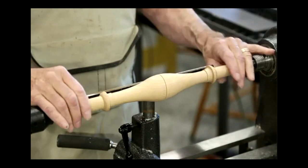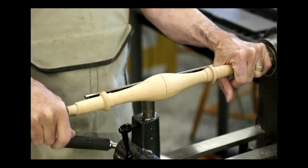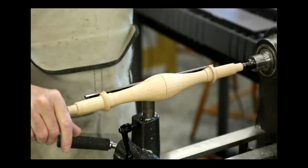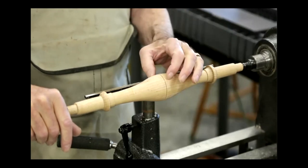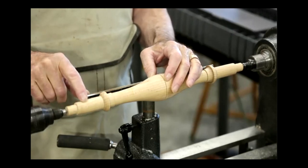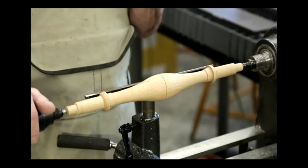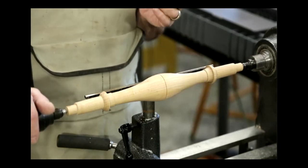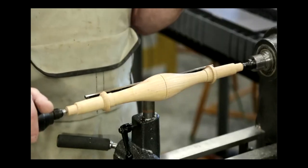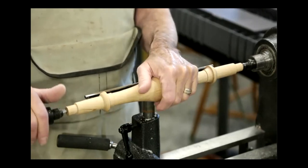You could be on a bobbin turning like this, and this goes in the bottom of a Windsor chair. The two chairs are going to be at least a couple of feet apart. So you could be off by an eighth of an inch on the diameter of the bobbin and probably a 16th anywhere up in here, even maybe an eighth, and nobody would see the difference. Because the unwritten assignment to the viewer when they view something like balusters in a spindle, legs on a chair, is to make these things look alike.